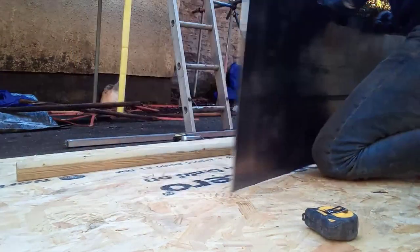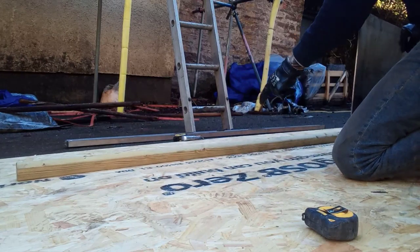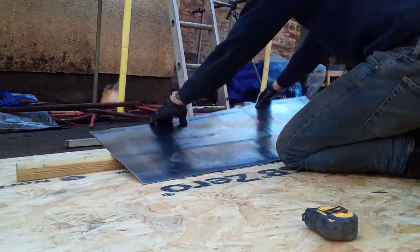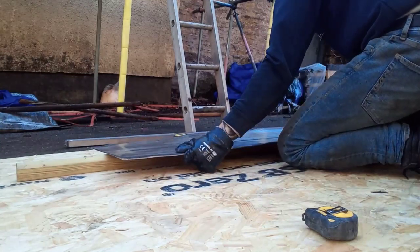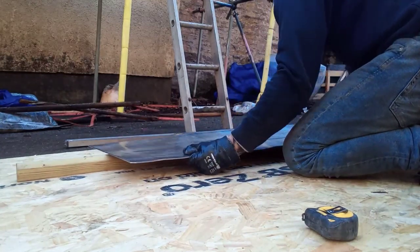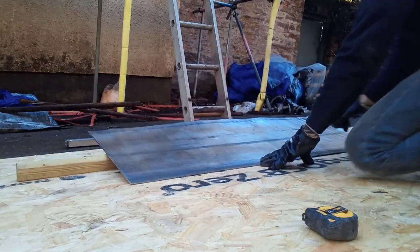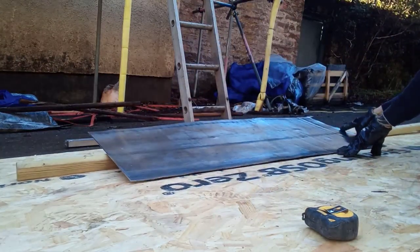225 because the lead is 450 wide, so it's right in the middle of that sheet of lead. We've got our mop stick already fixed to a board — screwed down in place so it's nice and strong and sturdy. We simply rest our lead on top, making sure that our markings are in the centre of the mop stick at the top and the bottom.